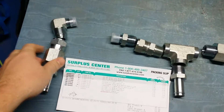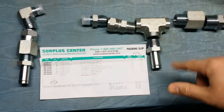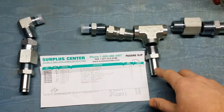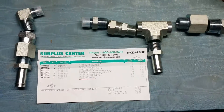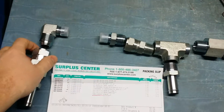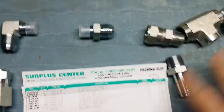So once it actually gets warm enough, I'll go ahead and put these together. Just a tip too that I've found with getting the tube to bend for this: get some super hot water and either soak the whole thing in or at the very least soak the two ends in. Then you can get a nice real good bend on it. The nice thing with these swivels is that if I need to get in to maintain the pump, I can take that off, unscrew there, and I'm left with just that — so it takes all this stuff out of the way.